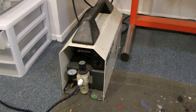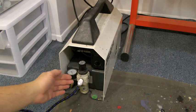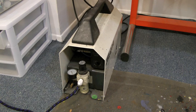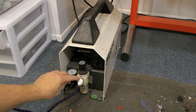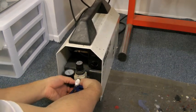The beeswax will be in case for some odd reason I do have an air leak. What I will do is I'll put the beeswax around the threading, but not too close at all, because you want to put it on and get the beeswax in there. The beeswax is sort of like an old school way of sealing airbrushes. The way my professor taught me to do it was you put beeswax around it, you get a lighter or a match, it kind of melts in there, and then you could put it on your hand and go around. It's an old way. It still works. I do use it for some of my Badger airbrushes because those things really need to be sealed, which are a pain.